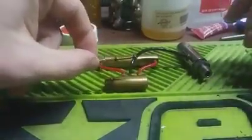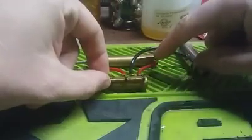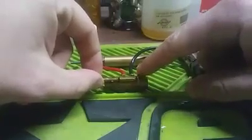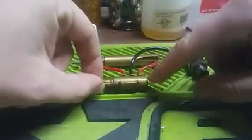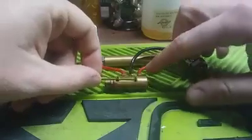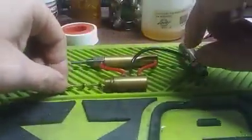This is kind of where the debate of whether people call them three-ways or four-ways comes in. Both sides are going to have a little bit of air, so currently there's air sitting in here. When we distribute that to the other side, the air that's in this line has to go somewhere. So it's important to have the correct clearance and make sure you're using the right three-way rod, because this has to vent outward. Some three-ways like this WGP basically just vent out the central bore, whereas some like the Shocktech bombs or the Inception Designs UFCs have little ports in the end.